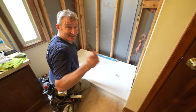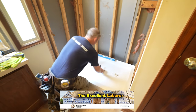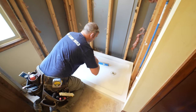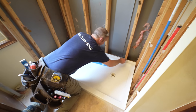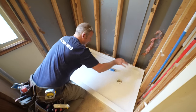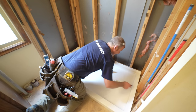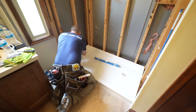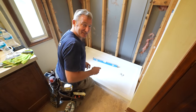I want to thank Excellent Laborer for this idea. Basically, once you get your pan nice and level, just go ahead and mark your studs. So before I put that mortar base down, I'll put these marks up against the stud and it'll give me a reference point of where I'm supposed to be when I set this in mortar. Great idea, Josh — thank you.